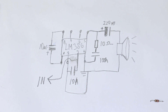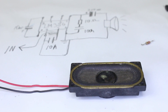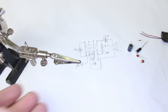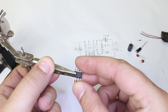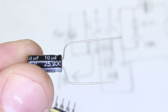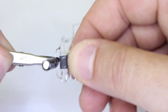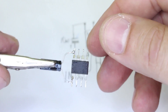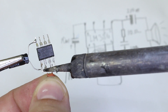Hello Hacktubers, this is the amplifier circuit and these are the components you need to make this mini amplifier: a small speaker, 9V connector, 3.5mm audio jack, LM386 integrated chip, 10uF capacitor, 220uF capacitor, 10nF and 100nF capacitors, and one 10 ohm resistor. Now let's build this amplifier — and stay tuned to see how you can run it as a Bluetooth speaker.